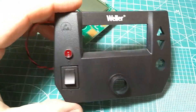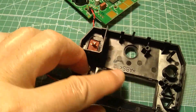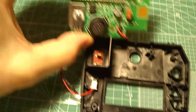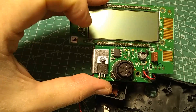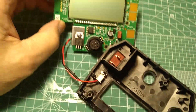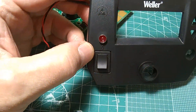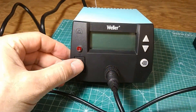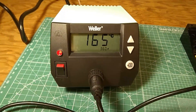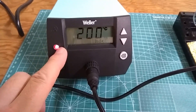Before putting everything back together, make sure the plastic screen on the inside is free of any particles, dust, or debris from drilling the hole, and clean the glass of the display as well — otherwise you'll be annoyed by debris visible on the LCD. Now with everything reassembled, when I flick the switch I have the pilot light on along with the LCD. Even if it's darker in the room the light is perfectly visible, so I'll never forget to turn off the station.